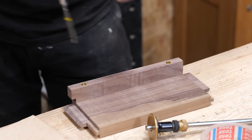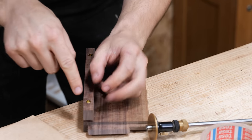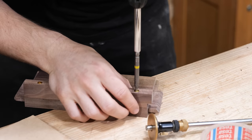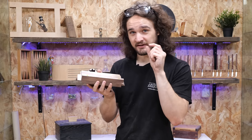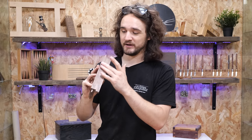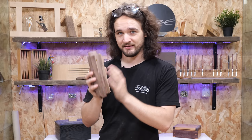The advantage we have here is that because we drilled those clearance holes slightly larger than the screw, we've got a tiny bit of movement if we need it. You'll need glue to secure it in its final position because the countersink on the head of the screw will force it to center itself, but we will have a tiny bit of movement — you literally can't feel a step there whatsoever. That in itself is a reason to do a clearance hole: it makes screwing together easier and more accurate, and that tiny bit of adjustment can be the difference between a step and something completely seamless.